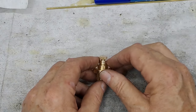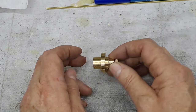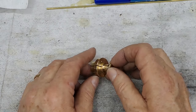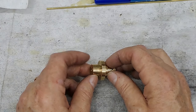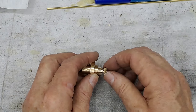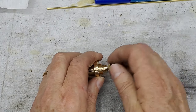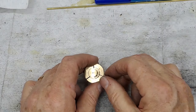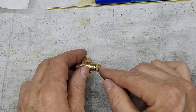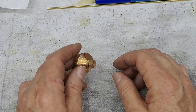You put that little piece, this is for M6, this particular split bush, in the chuck. You line that center pop up with the center of jaw one. And as you tighten the jaws down on the three jaw, this whole thing clamps down so that this will not rotate. It's only maybe a thou or two thou compression, but so long as everything's gone right, it's going to stay put. Now, of course, I'm going to put this into the three jaw chuck, turn that off, put a little center pop, center drill into the end, and then drill through 1.6 mil for an air hole.